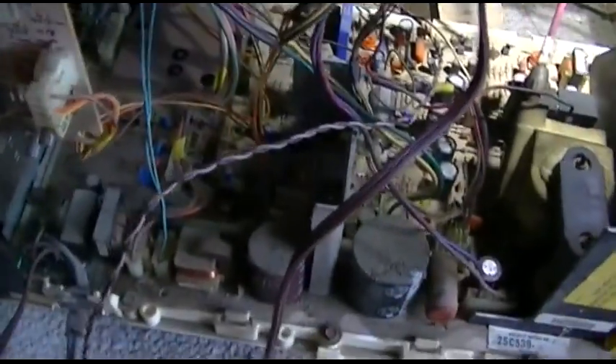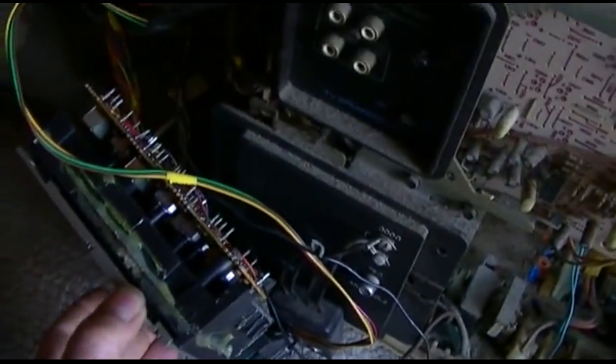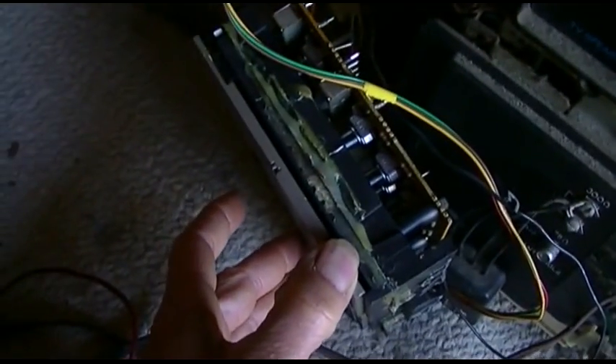Now I've gone around both of them with a 47k just for testing. They probably want them in series because they don't want 250 volts dropping across one single resistor. There we go — we have high voltage again.